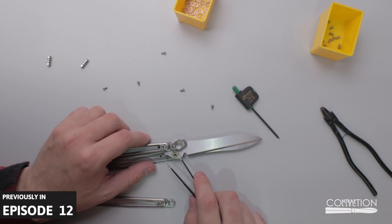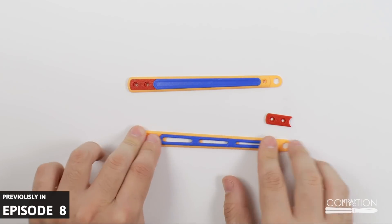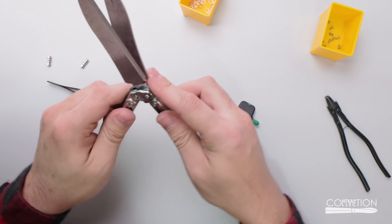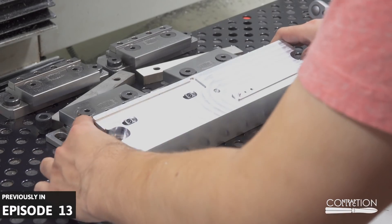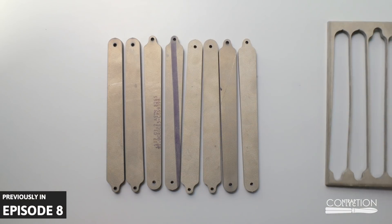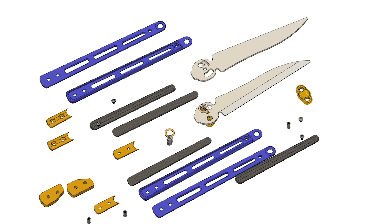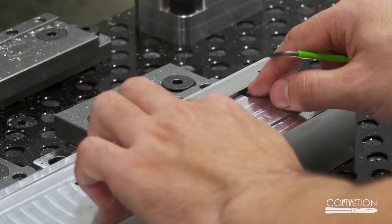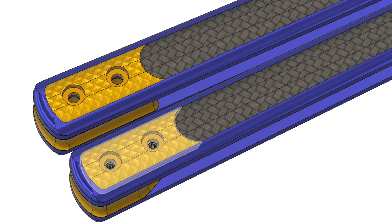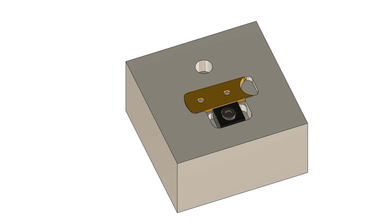The last time I made a metal prototype I came up with the idea for interchangeable scales, but I never actually made them. That's what I want to do in this video. But first I have to make what I'm calling the scale clamps again. Originally I had planned on making nicer fixtures, but my last video made me realize I'm gonna want to have blanks of the parts water jet cut. I think despite the higher material cost I should try to do everything with thicker stock in only two operations, but I'm not sure if I can do this for every part. I gained confidence in how little material I could hold with pitbulls in my last video, but I'm still worried it'll be hard to hold on to the scale clamps for the second of the two operations, so I designed a tiny fixture to try it out first.